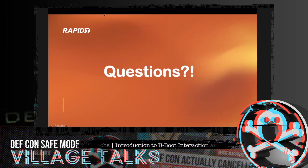Have to agree with that. I actually had a device I was playing with the other day, and there was probably a half dozen arguments in the environment variables that when I changed them and saved them, they never saved. So U-Boot's a funny beast. Everybody compiles it differently, so the amount of features, functions, capabilities, and how it works is very configurable. And every vendor will compile it and use it differently.